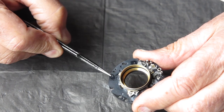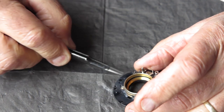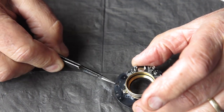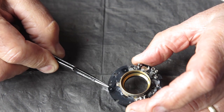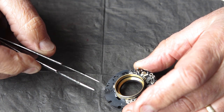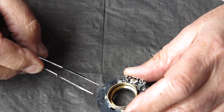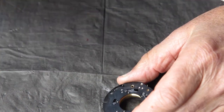That oil would have been trapped underneath the retard gear train and the self-timer. Both of those gear trains have held oil trapped under there, and it's very likely that oil was either there previously or has been flushed there as the blades were cleaned. This certainly needs to be disassembled and cleaned correctly - there should be no oil on the mechanism plate.